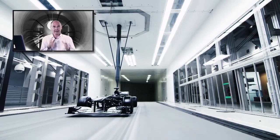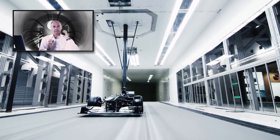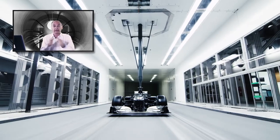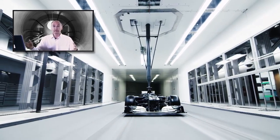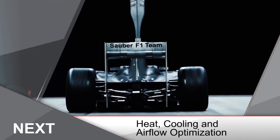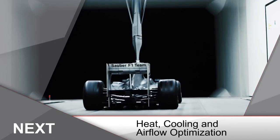So the energy we put into the air, we have a 3 megawatt fan. If you're driving at full speed, those 3 megawatts effectively generate motion. You call it Brownian motion. It generates excitement between the molecules in the airline, and that energy becomes heat. So we heat the air up as we drive it forward, we have to take that heat out of our airline.